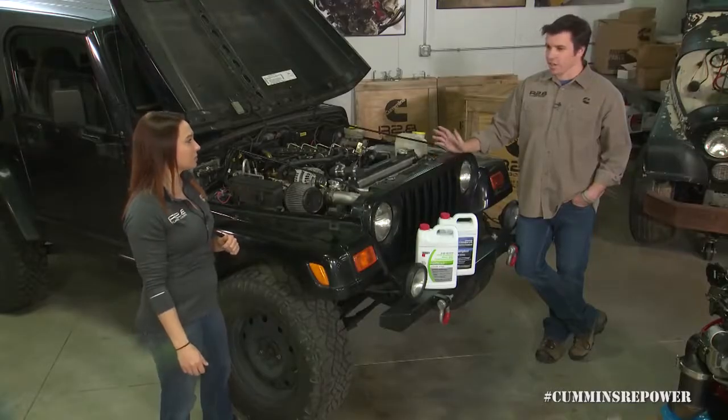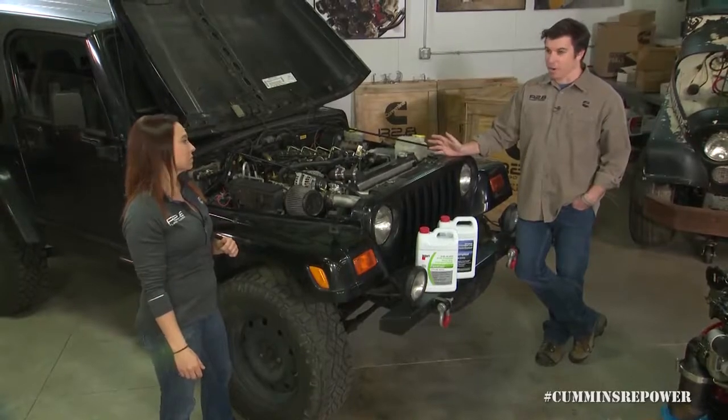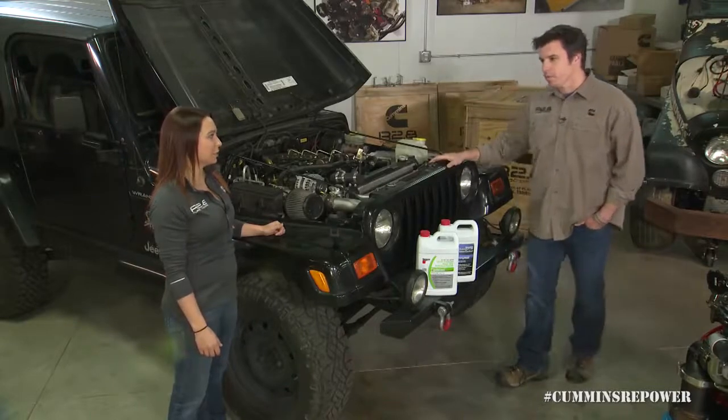If you're off-road, you're going to see around 176°F to 180°F pretty much regardless of conditions. If you get on the interstate pushing 38-inch tires at around 2,400 RPM, it's probably going to climb up to 205 or 210°F — and that's okay. It can be unnerving to see that sweep and think something is wrong or that your cooling package isn't dialed in, but as long as you're below 225°F, you're doing fine.